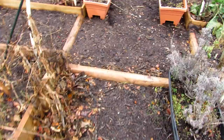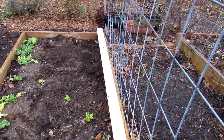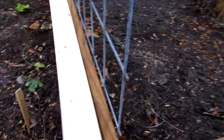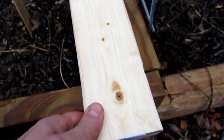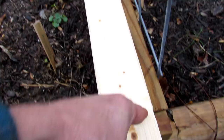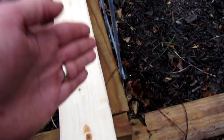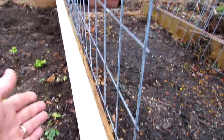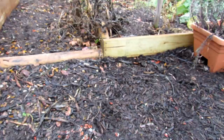Because your frame beds are going to be different sizes, the dimensions are going to vary. When you buy boards listed as 8-foot, 9-foot, or 10-foot, they're not exactly that — they could be a little less or a little more. This is an 8-foot bed, but I capped it on the outside, so I really need a 9- or 10-foot board on top to have the extra space, because we're going to put 3-inch screws in here to secure it. I'll come back and cut off the overhang. I'm going to put what I just built right here, and when I slide this over and insert the panel, it'll get rid of the slant and should be pretty secure.